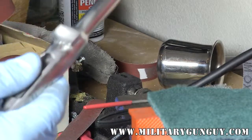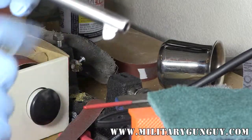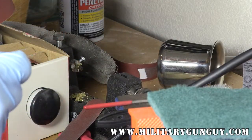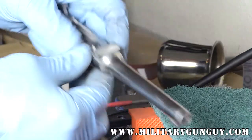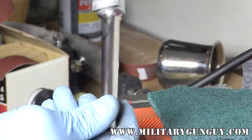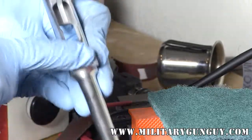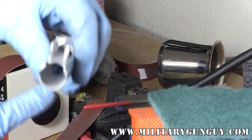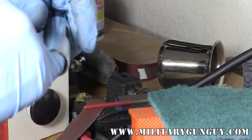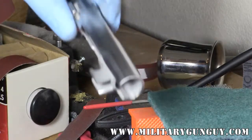From when we started, this thing was pretty badly pitted. There's still a little bit of pitting under the barrel I could probably get out with more belt sanding. If I'm going to go this far, I want this thing to look as nice as possible. I'll end up polishing this out by hand with a Dremel and a stainless steel brush. This is all going to get rust blued — with the exception of the inside. The problem with the Dremel is keeping the pressure even, so I would never use it in areas where you'll end up with little scallops and gouges.